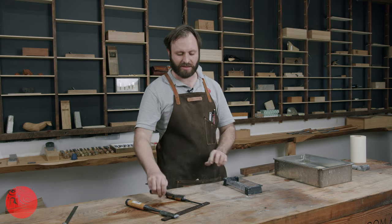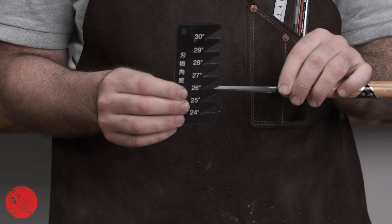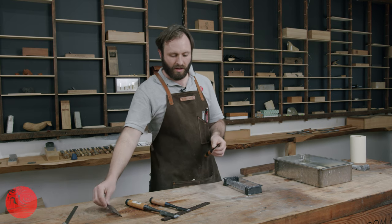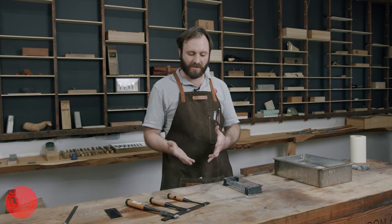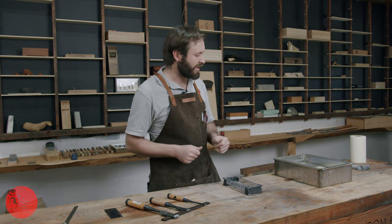This 6mm here is actually a little bit lower than that — it's closer to 26 degrees. If I really want to reset a bevel angle to about 30 degrees, I would put it in a jig and go from there. However, when the factory comes quite close to 30, I try and roll with that and see how we go.